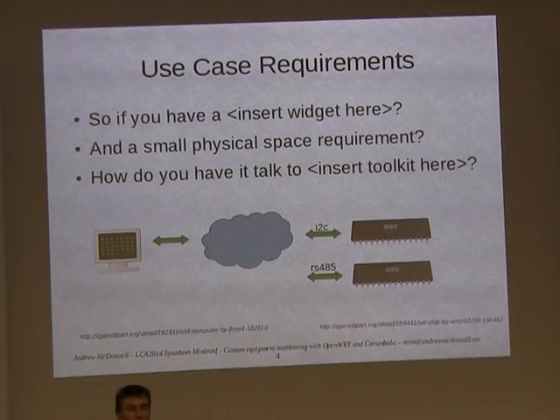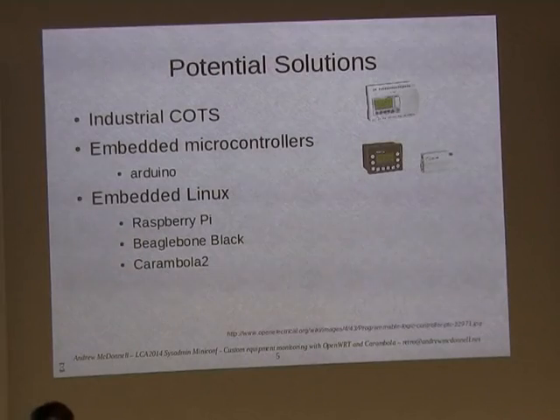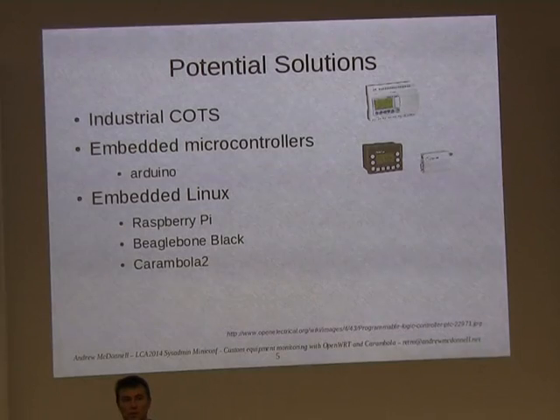With TCP, IP and UDP, you want to be able to plug into your standard systems with SNMP, email, or anything else. There are various ways you can solve this problem. You could use a PLC, but they might need more space than you've got, they usually want to run on a DIN rail, they might have a whole custom suite of software, and it might start getting expensive, especially if you want to integrate into a custom system of your own.